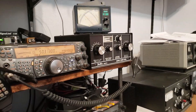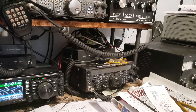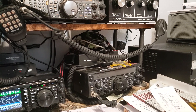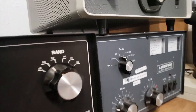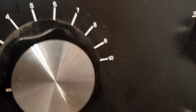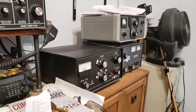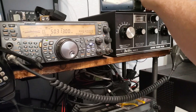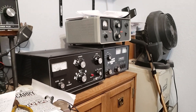Now let's tune the amplifier. We turn on the amplifier and have to tune it so it is properly adjusted for the frequency you're going to use. We're on 80 meters here. Turn the band switch to 80, and there are tuning and load knobs. We're going to set the amplifier knobs to achieve maximum power output. I'm going to switch my range to 200 watts. We're still on that same frequency — assuming we're going to operate here. To avoid wearing out my on-off switch, I plug the amplifier into a heavy-duty power strip.